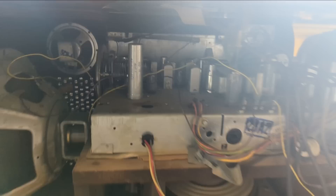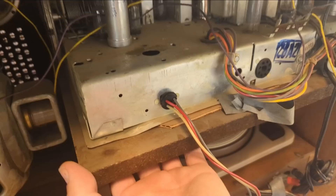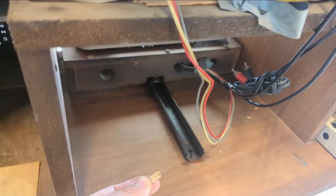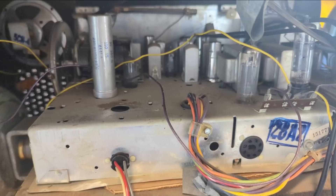The next stage is to rebuild this chassis. I don't suspect this is going to be terribly complicated. There are bolts underneath, so I'll push the record player out to get at them. I have a sneaking suspicion underneath it will be similar — probably some black bakelite caps, maybe some ceramic caps, and one electrolytic on the chassis here reading 60, 30, and 100 microfarads.